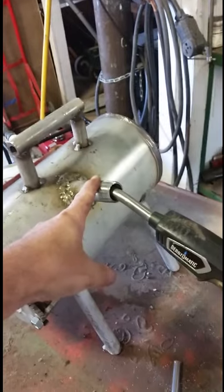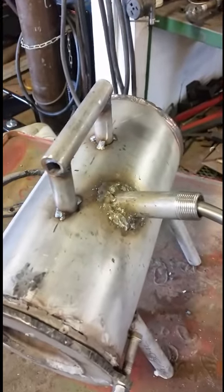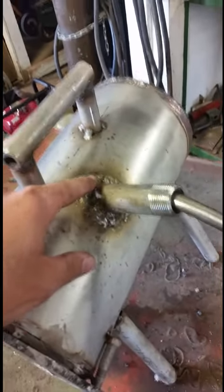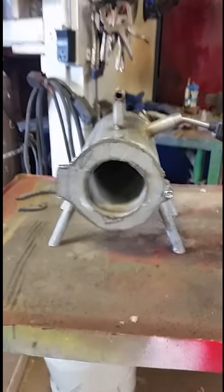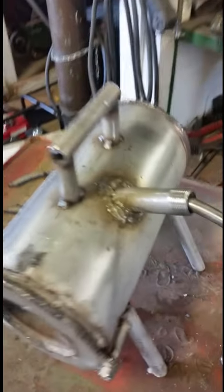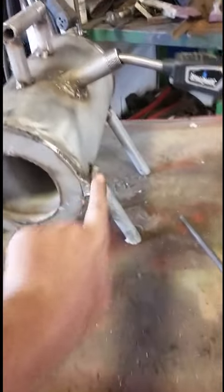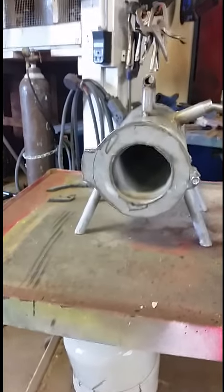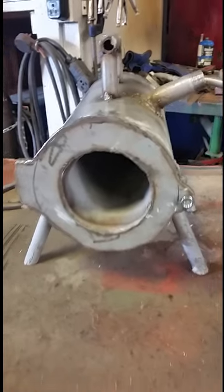Three quarter inch tube here. He had the threaded piece of stainless. These welds are ungodly — it looks like hammered dog crap but the angle was not quite right. So I changed it and I think I did a little bit better this time, but I had to cut it out. It had a huge gap so I had to fill it. I hope to God it holds because I MIG welded it instead of TIG welded it. Weld bolt on for this little front plate — I don't really know that it's necessary but it just looks a little better and I thought maybe it might protect the front a little bit, beating on it, pulling stuff in and out.